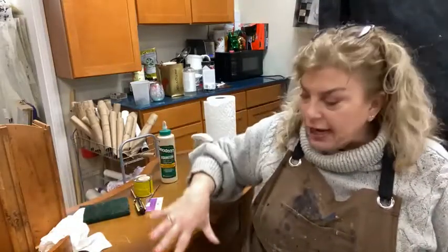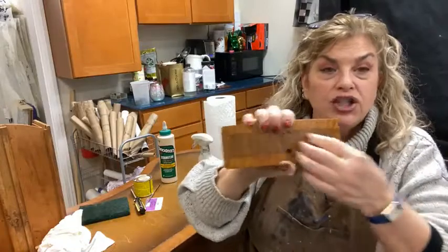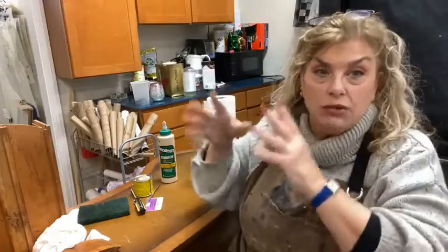We're not going to talk about primers until we finish repairs. I wanted to explain the shellac situation — now that I've cleaned all this, I know I've probably broken through all the old varnish and could have product leaching through, and shellac is the way to go. No water-based primer, nothing else will keep tannins and oils from bleeding through your white and light-colored paints the way a shellac primer does. I've tried them all — what really works if you're having problems with bleed is shellac. It's old fashioned, smelly, a little messy to work with, but it is what works.